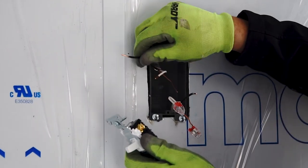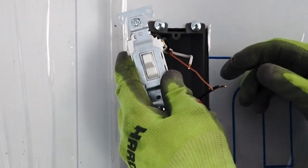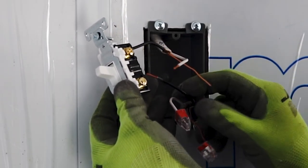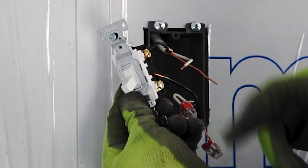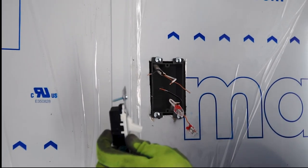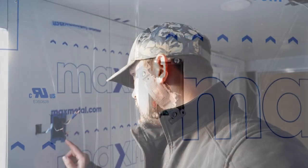We're going to wire up the line coming in from my shore power from the breaker box up here, and then the wire going to my outlet goes down here. When you flip it on it connects, flip it off it disconnects, and the other wires are just tied together going down to the outlet.